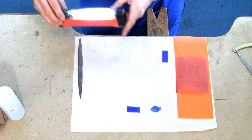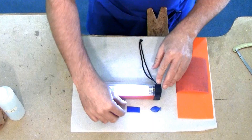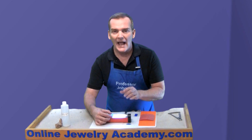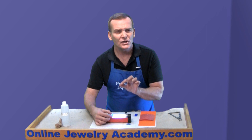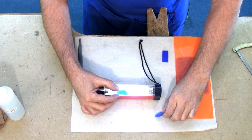Now let me show you how it works. I'm going to bring out a little fluorescent light. If I put the wax thickness guide in front of the light, you can see that as the wax gets thicker, you see a darker and darker shade of blue. And if you use this with a pair of calipers, you'll know exactly how thick the wax is.